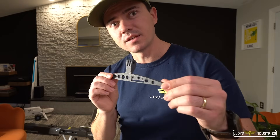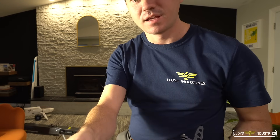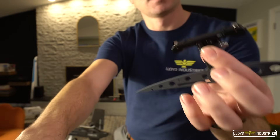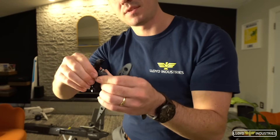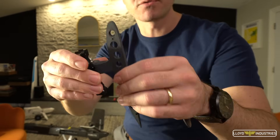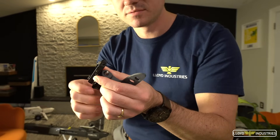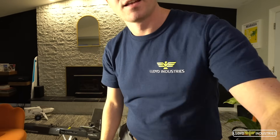I've 3D printed this little piece that is meant to replace this piece right here. As you can see, it has a little GoPro mount where we'll be able to attach this piece, attach a screw, secure it, and we'll be able to mount the Insta360 camera on the tip of the wing. And I know it looks pretty flimsy, but it's actually quite tough. It is printed out of carbon fiber reinforced PLA, so I'm hoping it should stay on pretty solid. Let me show you how we get this onto that.